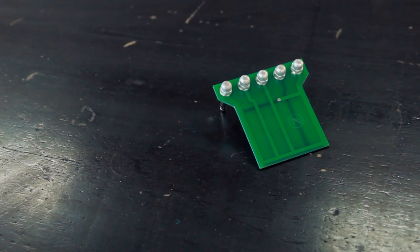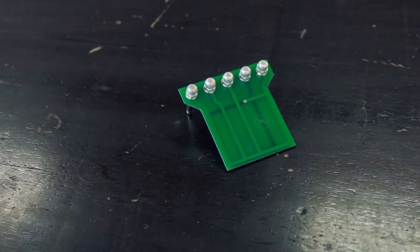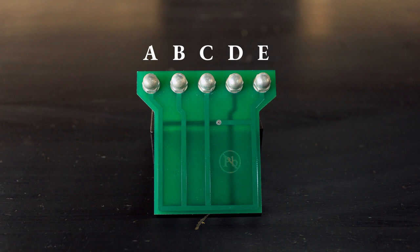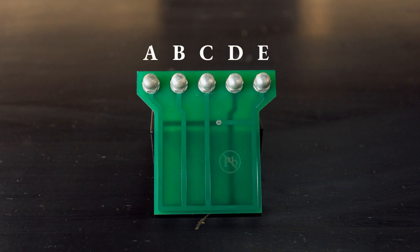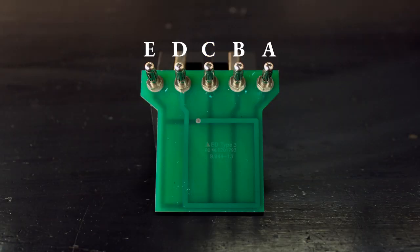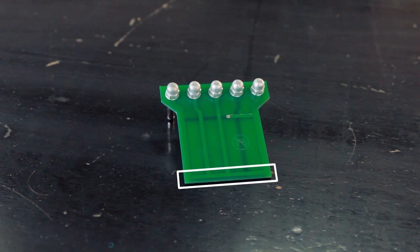This is a PCB, a printed circuit board with embedded conductive pads. It has 5 connectors at the top. When 2 of them are connected to the current generator using cables, current flows through the suitable pad. The PCB has 2 layers. The back layer is added in order to increase the length of one of the pads. The horizontal section of the pad at the bottom will be placed inside the magnetic field. The length of that pad with non-zero current is important.